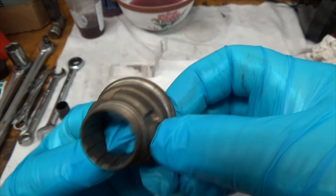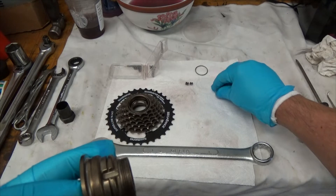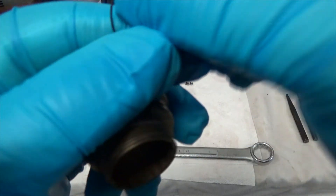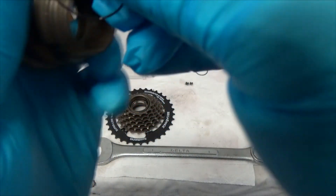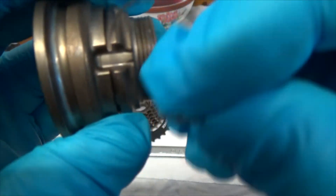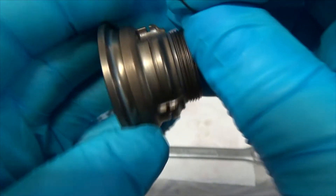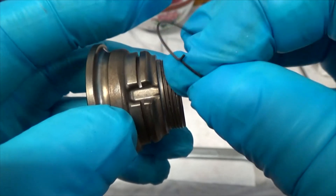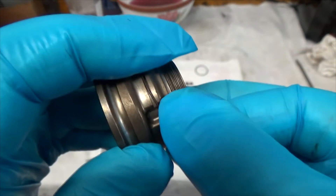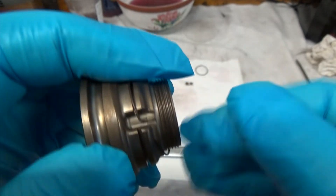The two remaining positions will be open. You can put the spring on first and then slide the pawls underneath it, which is what I'm going to do before I grease it up. You have your clip on here — see how it's bent up — that goes into one of these slots. We're going to put our pawl in here and then the locking ring in place.